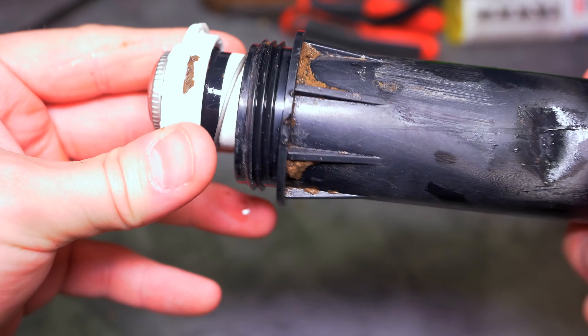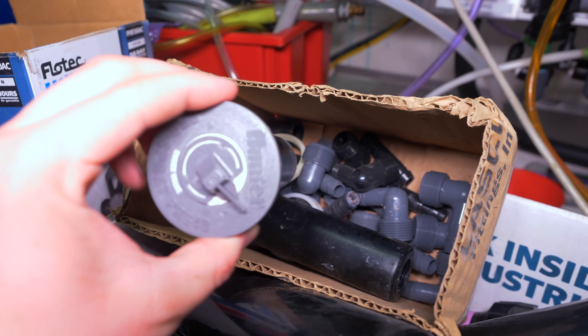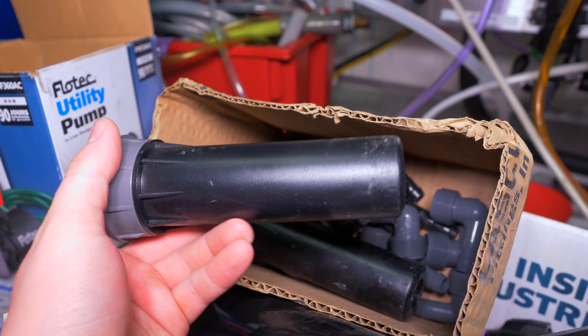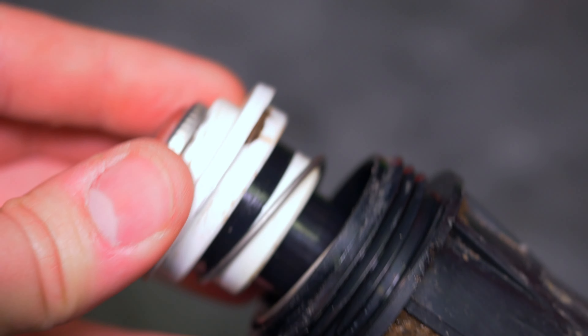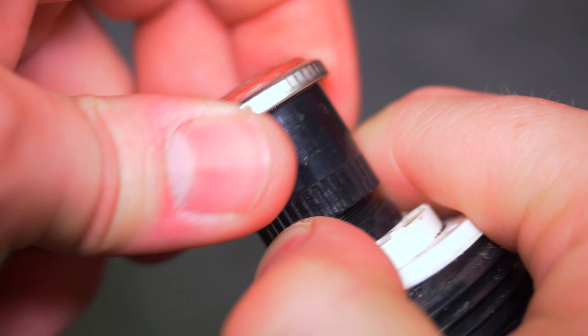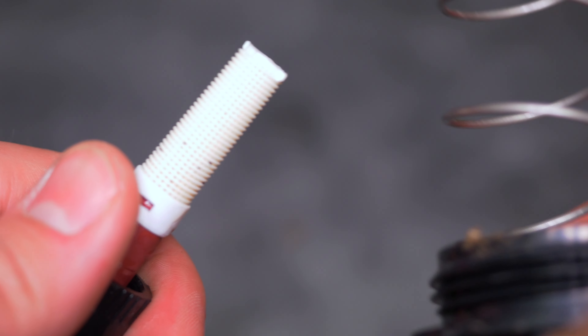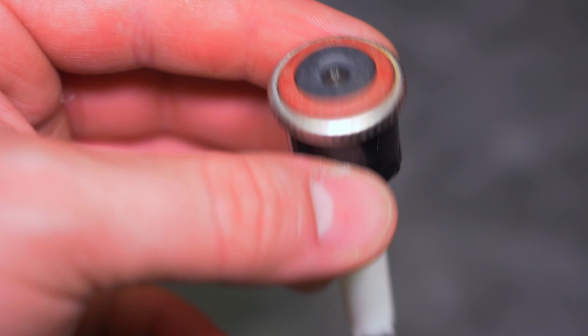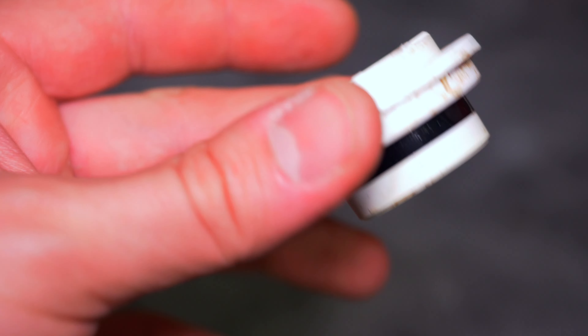As you can see, it is not going anywhere, so this entire body needs to be replaced. I'm really curious as to what caused that. It is for this reason exactly why we keep a couple of spares around - we've got two spare 4-inch Pro Spray PRS-40s right here, brand new, still have the flush cap and no big hole in the side. I'm going to get this nozzle off of here. There we go - here's the nozzle we pulled out. This is an MP1090 210-degree. The wiper seal actually still seems to be in pretty good shape.